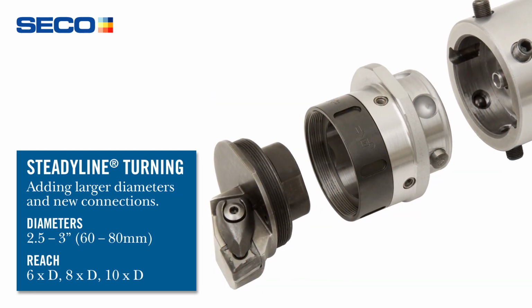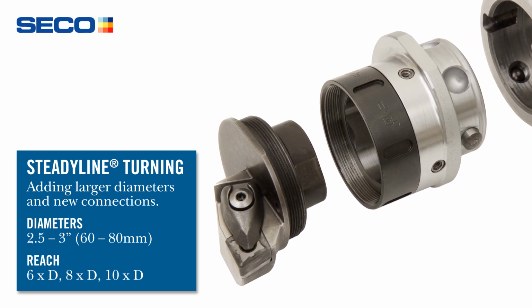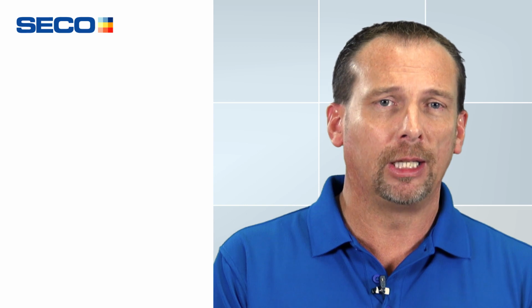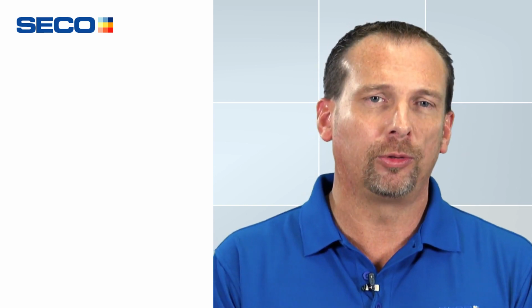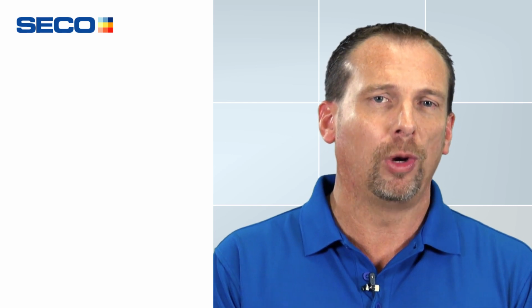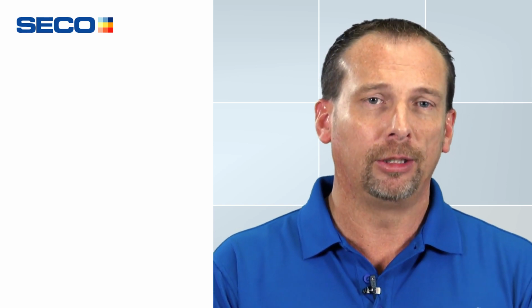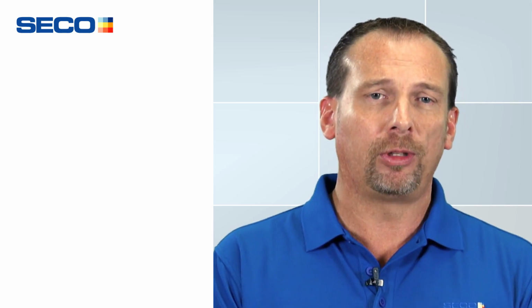With these bars, there's going to be a new conversion so that you can use our standard GL50 heads with any of these bars. There's what is called the BA to GL connection. The BA connection is a Graflex type connection that centers it well and then has the opportunity to use the different GL50 heads. Those adapters are actually available with 2 different drops, which means from the center line out to the cutting edge. The one actually puts you real close to the bar diameter, but if you need to get into larger diameters, we have a secondary head that actually has a dimension longer and helps give more relief and clearance for chip evacuation.